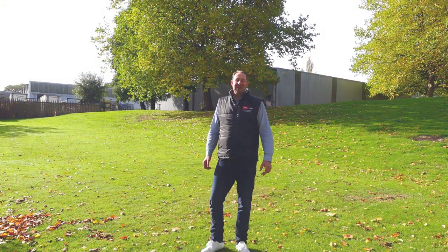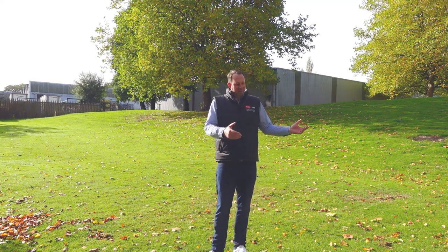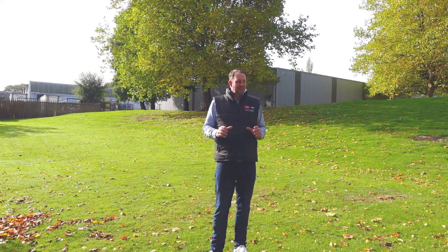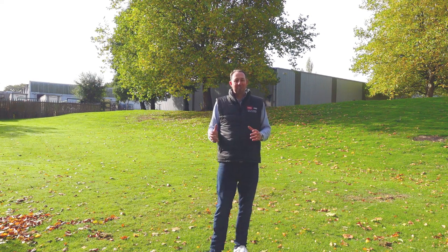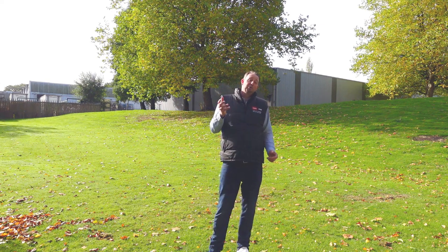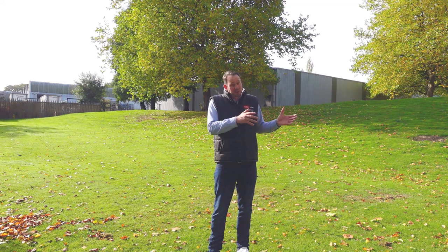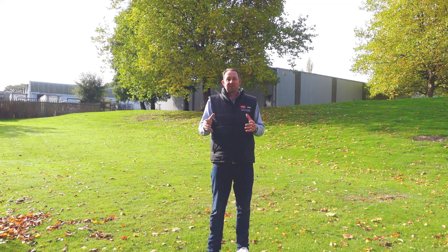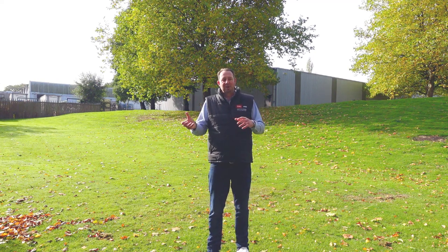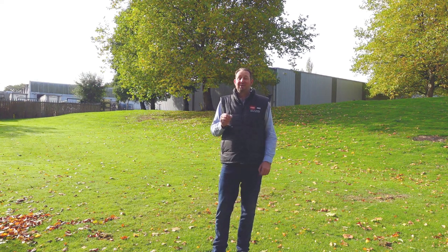Wow, what an experience that was. Started off at this side of the factory — unbelievable — all the raw materials coming in, sheet metal, box section steel, all stacked up in the stores. Then it's being picked, taken over to the machines, all laser cut out, they're bending it, folding it, welding it, shot blasting it, painting it, assembling it all the way through to the finished product where the Hayter mowers are boxed up and ready for dispatch. We even saw some of the big Toro mowers through the various stages of assembly, coming through along the line being put together and then thoroughly tested at the end — fluids in, test them, run them, take the fluids out, move them to storage, bring them out a week later and test again.